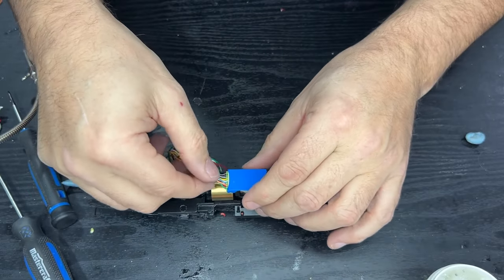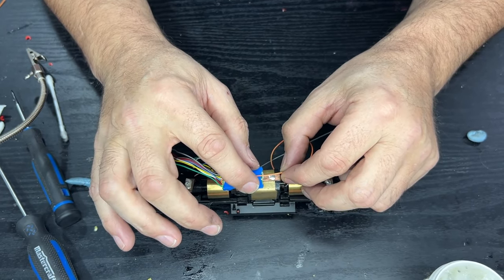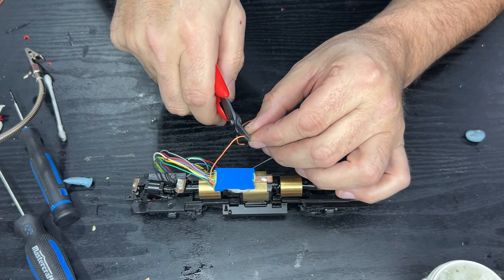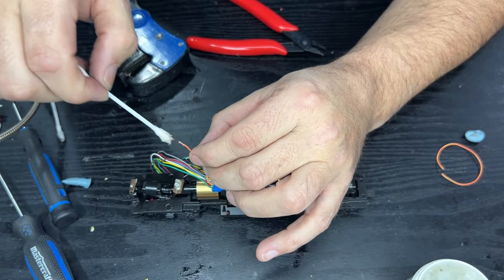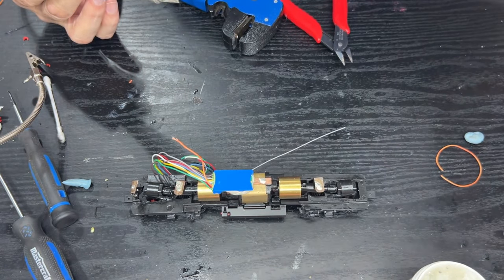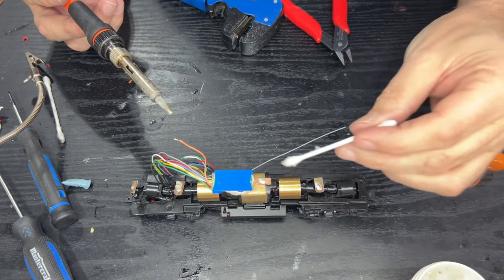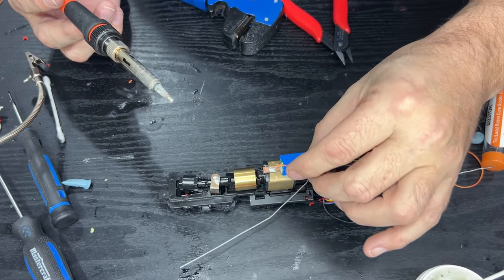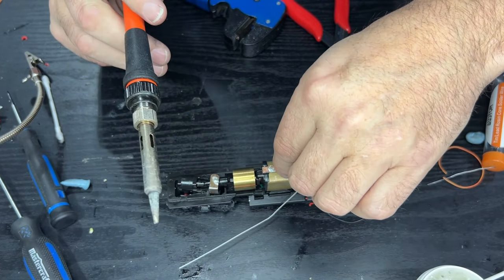Okay, let's get some wiring done finally. Orange wire is the output from the decoder into the positive of the motor, so that's going to go there. Cut and strip that back, a bit of flux, a bit of tinning - need a bit of solder for tinning. Get a bit of flux on this connection here and get our first wire finally attached. That's actually the second wire because we've already got this gray one, which now has to join onto the gray one coming out of the decoder - which is why I made it gray.